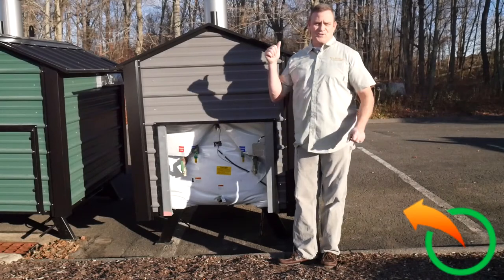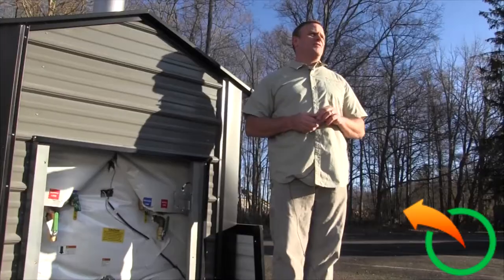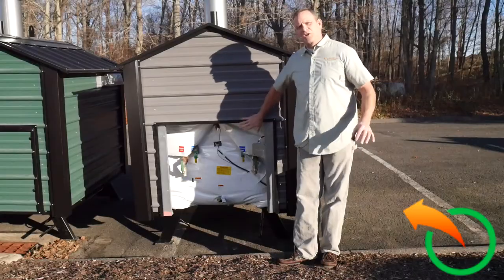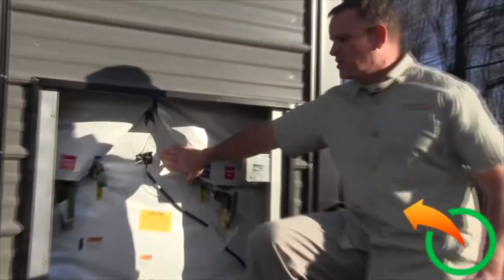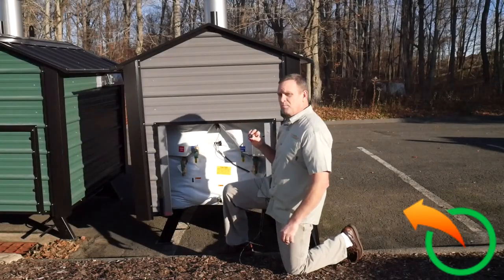This applies on all Woodmasters: the 3300, the 44, the 5500, 6500, the 546, the 323 — all of them. Just take off the back control panel. The snap disc resides right here. I peeled away the insulation a little bit, and it sits against the back of the drum to monitor the temperature of the water in the wood boiler.